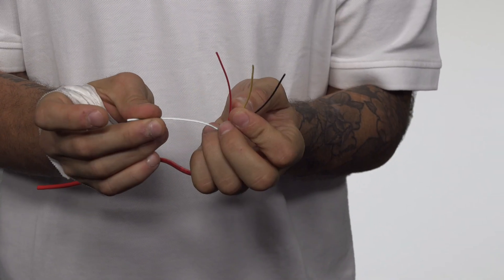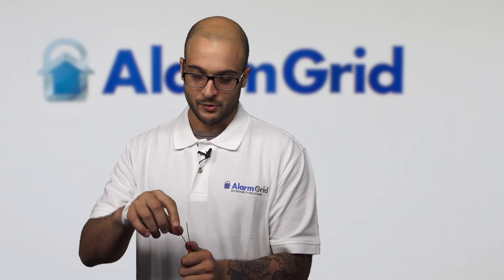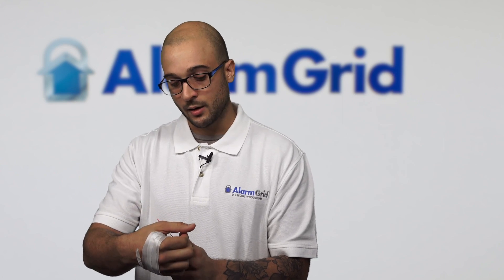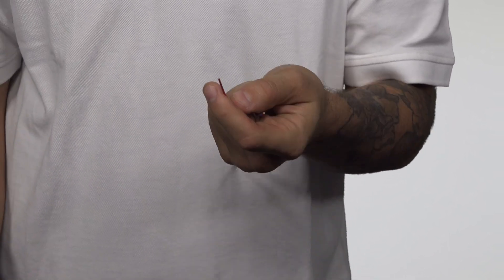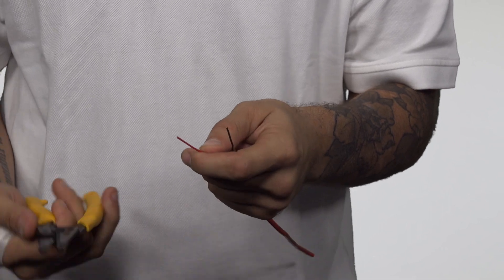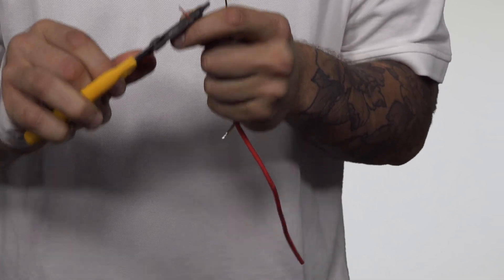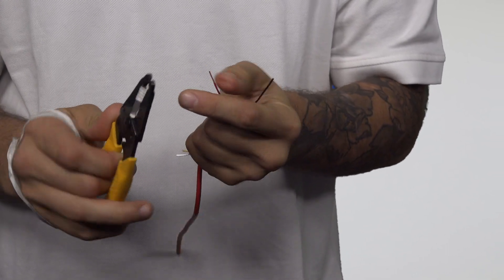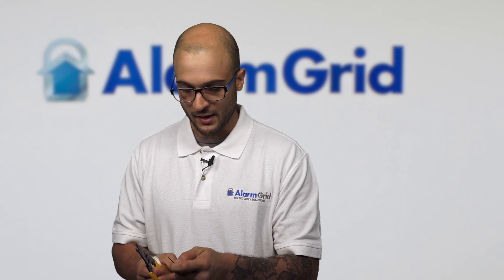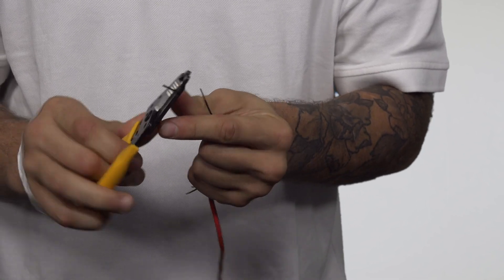As you can see, we have four wires in this cable. For convenience, and because we're using power, we're just going to isolate the red and the black. You want to use the red on the hot or the plus, and the black on the negative or the minus. The wire actually has sheathing on it, so we're going to have to strip that to get it to go under the terminal. The best way to do this is to take your stripper, lay it on the wire, and apply just enough pressure to score the sheath. When you feel it go down a bit, release the pressure and then pull with your finger, and it will slip nice and easy off the wire. It's important not to nick it, because when you go to bend it you'll actually break the wire.